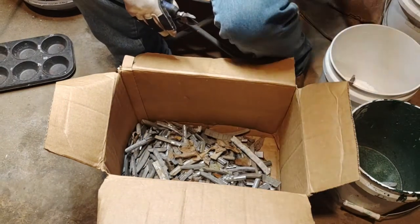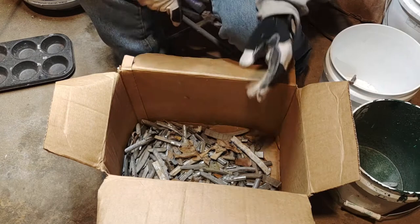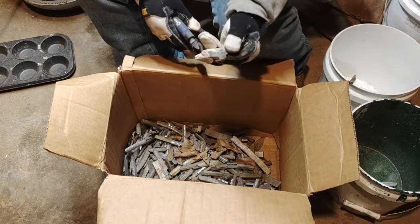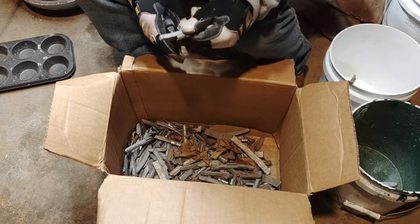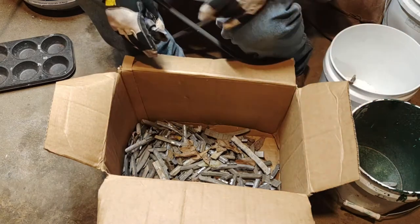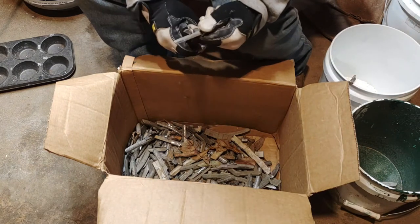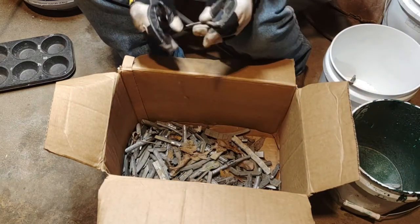The way I check whether it's lead is with a pair of side cutters. I just snip the weight — see how that leaves a good mark? Only lead does that. On stick-ons, see how it just snips right through? If you have zinc or steel, it's going to take a lot more force. Elvis Ammo also showed a tap test where lead has a really dull tap versus the ringing sound of steel. But that's led me astray, so I prefer to just nick them. If I'm not 100% sure, like on some softer zinc ones, I just leave them in the box. Zinc will mess up your bullets and corrode your melting pot.